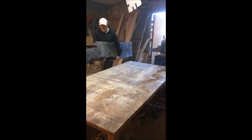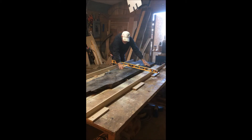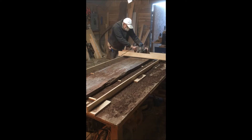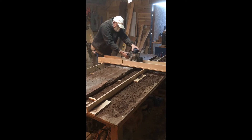Back at the dusty shop, bringing this big gnarly black walnut slab out to start leveling it up and flattening it on the router sled. I've got a big two-inch surfacing bit on the Bosch router and we just go back and forth slowly. The thing was so cupped, and with the knots it was a very slow process.